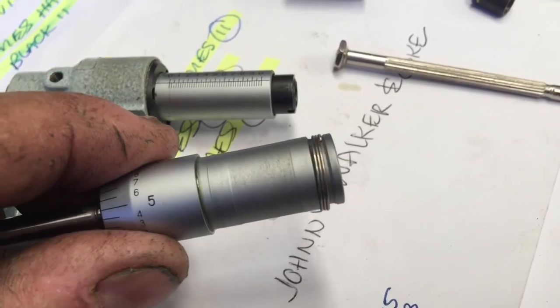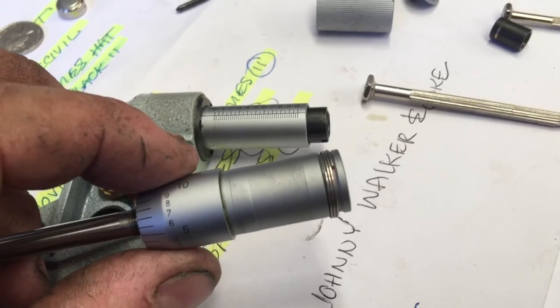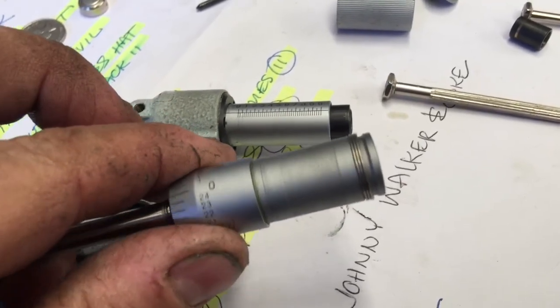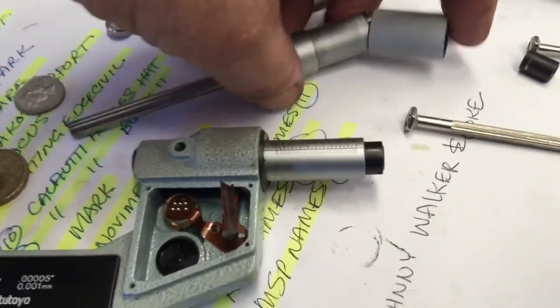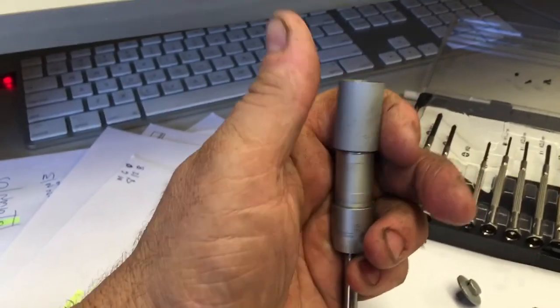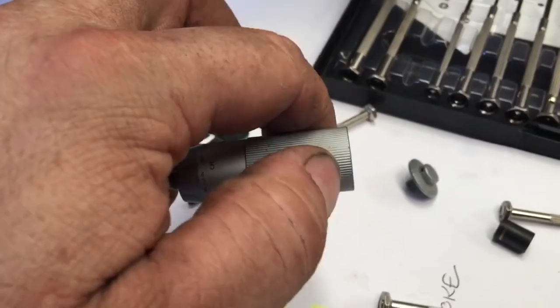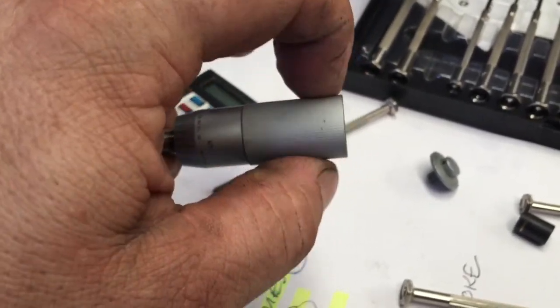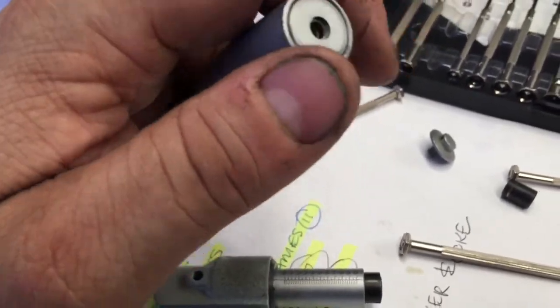I'll do a quick assembly. So with the spring on this way, with rotation clockwise, any friction with the spring would be inclined to loosen the spring, wind it inwards. So that's how it looks with the barrel, to get it started. It has free motion in one direction and it locks up in the reverse. So it's essentially ratcheting in the opposite direction and spinning in the forward direction.